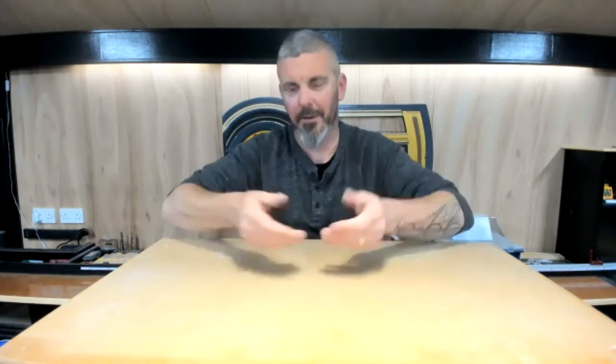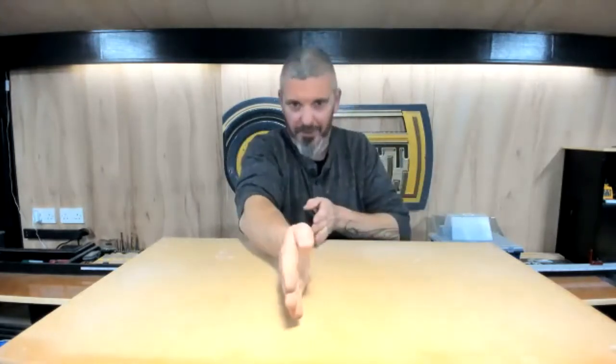If I was approaching that, I probably would be of the school, again, it's bang for buck. Imagine you have your dirty paint line coming down, and you have your lovely clean door here. What would be stopping you getting a roll of blue tape or yellow tape and creating a new line and painting it to that line? So rather than try to get rid of the problem, you're fixing it. I can't remember the last time I walked into a house and complimented somebody about the way their wall met their door. It's a very, very simple solution. Get your tape, put the line down, and you just create a new line. It's a clean edge.